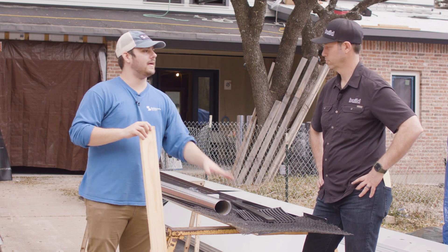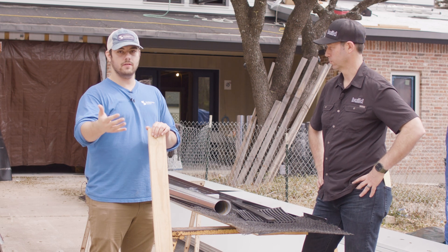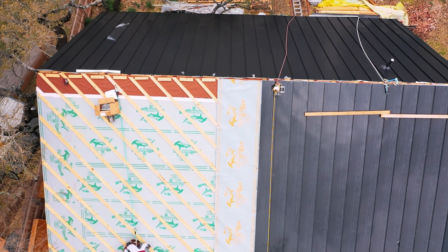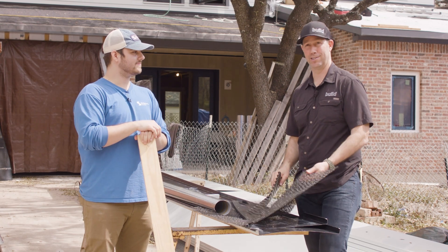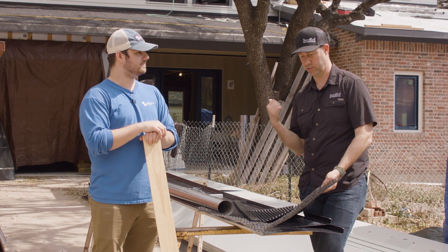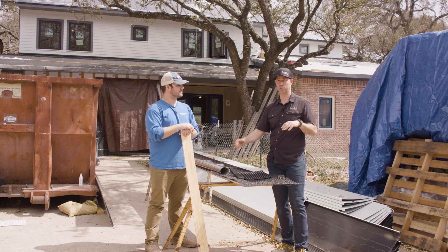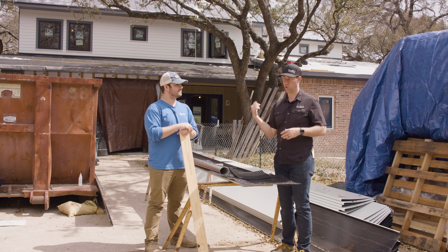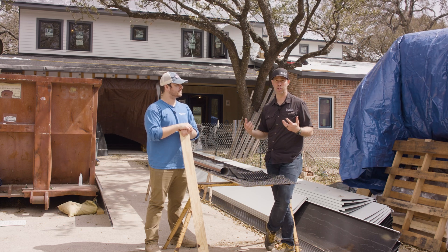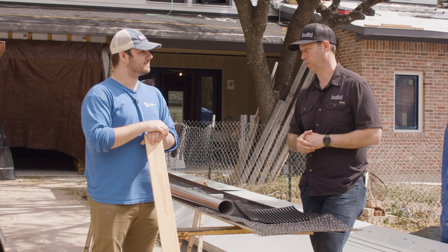With the 3D mesh and the dimple mat, you're still attaching the roof to the plywood decking, which adheres to that engineered product. On the pro side for 1x4 furring strips: on the steep 8/12 pitch, it just felt more workable and safer for the roofing contractor — Straight Line Solutions — since the 1x4s act kind of like toe boards. I'm not in a high wind zone and I don't have codes requiring a wind rating, so that's why I went with the 1x4 on the steep pitch.